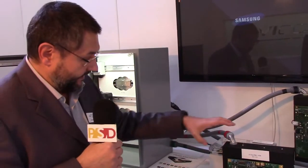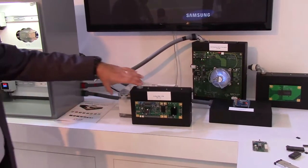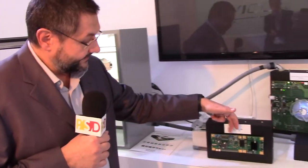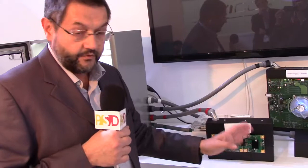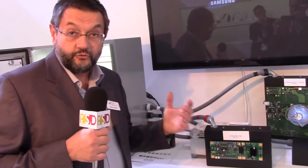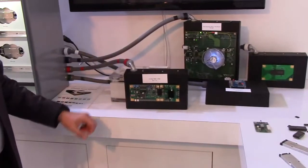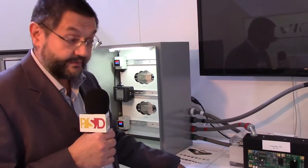Factorized power means you divide the fundamental building blocks of a power supply into two. One is the regulation block that works on a small difference between input and output, accepts a variable 48 volt, and regulates an intermediate 48 volt which we call the factorized bus. From the factorized bus we can step down to any voltage we want — even from 48 down to 1 volt in one single step — through the VTM, the voltage transformation module. Those two parts are each optimized for one function: one regulates, one steps down. A VTM can easily operate at 98% efficiency and the PRM works at around 97%, so when combined you still have a full conversion chain with very high efficiency.